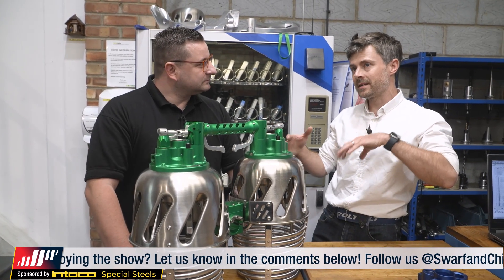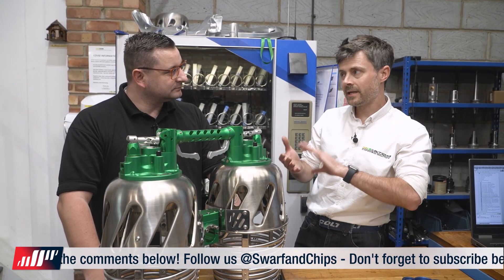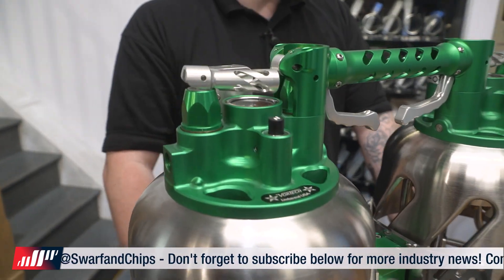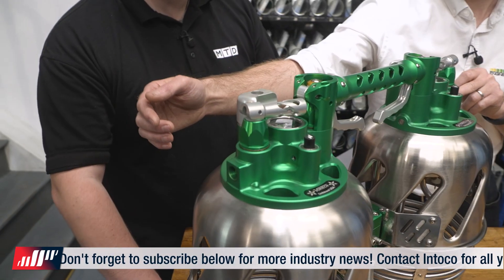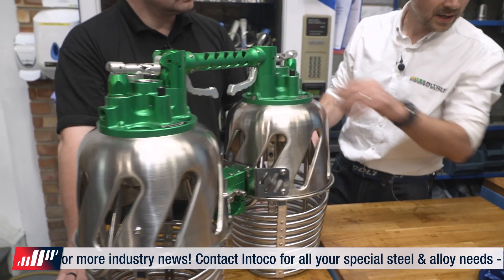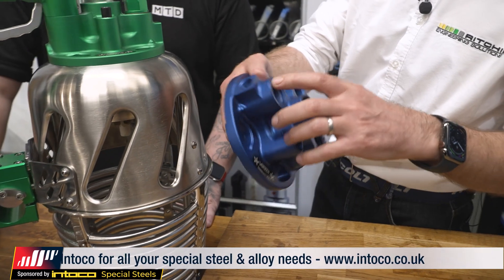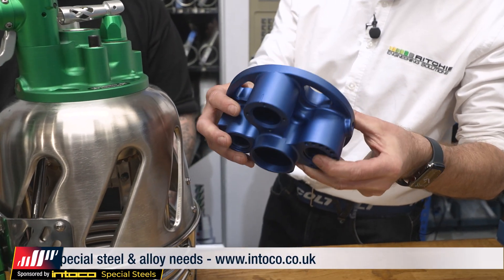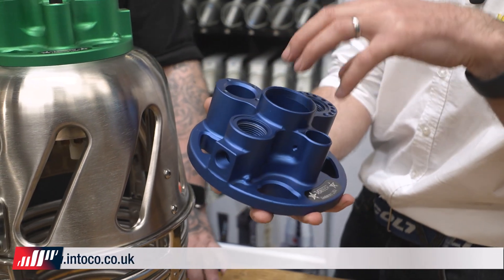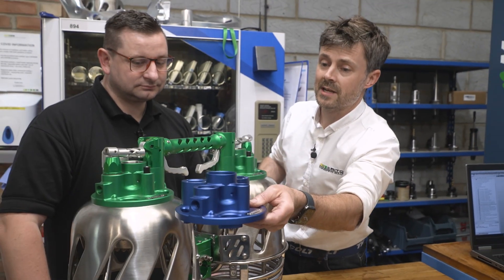First you would have propane cylinders within or around the basket, containing liquid propane under pressure — about 300 psi. Then fuel lines come in; we have a fuel line for each burner, with an entry here and an entry over this side as well. You can see on the manifold block itself there are lots of cross-drillings connecting and communicating various chambers to other chambers.